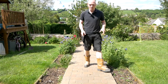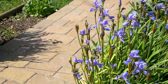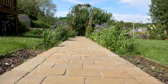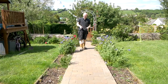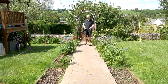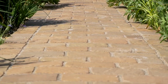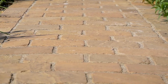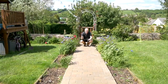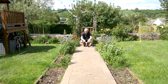This has got to be one of my favourite projects to date — the paths all the way down through the garden. It's something I'm pretty proud of, bearing in mind it was the first time I'd laid a patio or a path. Now these are sandstone, they're a bit more of a mix of colours, and again they're laid on a full mortar bed around 30 to 50 mil. I put a bit of a camber on the path, and it's not immediately noticeable, but as you come up from the lower garden at eye level you really do notice it and it makes a huge difference.